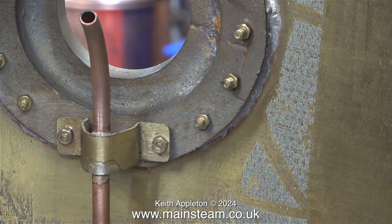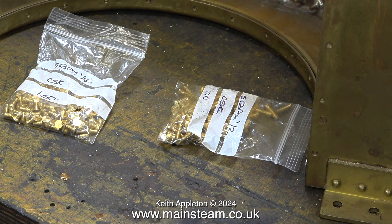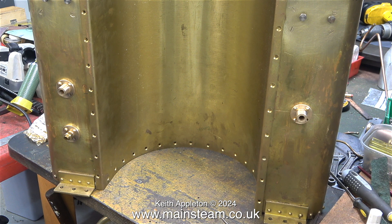At this stage I haven't tightened the union nut on the pipe at the other end, because before fitting these parts I need to coat them in sealant and shorten the bolts that hold them in place underneath the tank. Before I finally seal the tank, I will be fitting it to the engine one more time just to make sure it fits okay and that the mounting bolts align perfectly with the mounting bracket. Once I can successfully bolt the tank in place and remove it, I will remove it and then fit the sealing panel — and here it is. I think I'll be using a lot of silicone rubber sealant on this job.